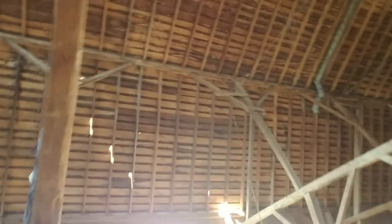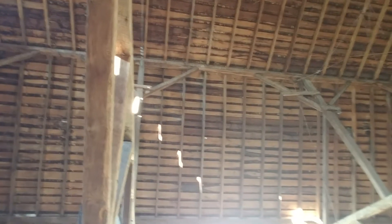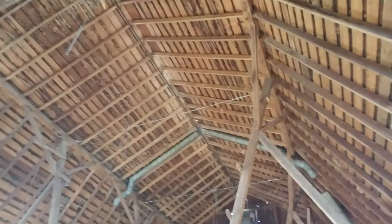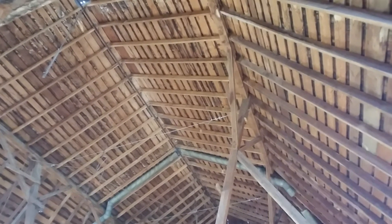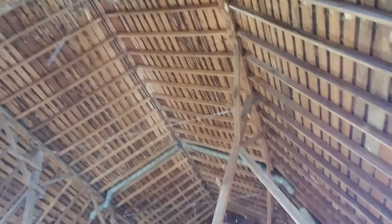Some of the upper knee braces from the mid-roof support posts to the 6x6 on each side were missing, so we replaced those. And when we did the cables up there, I added a 2x6 on the back side of the post to make sure that when we tensioned it, it didn't come loose from the beam above it.